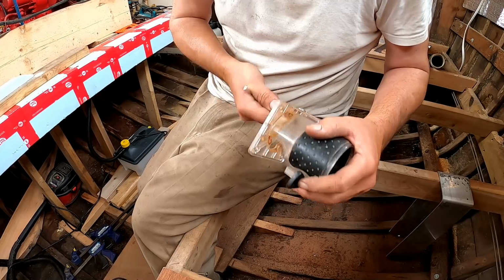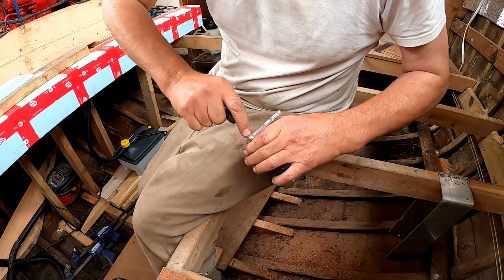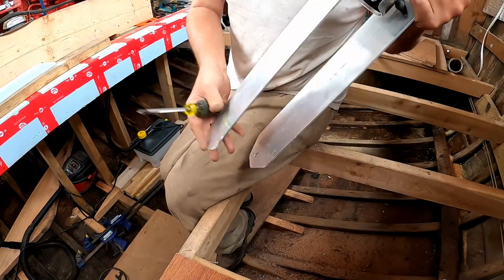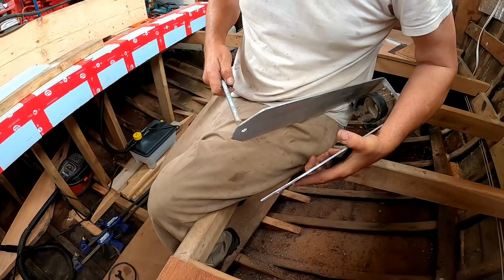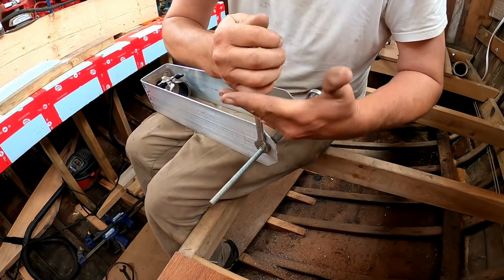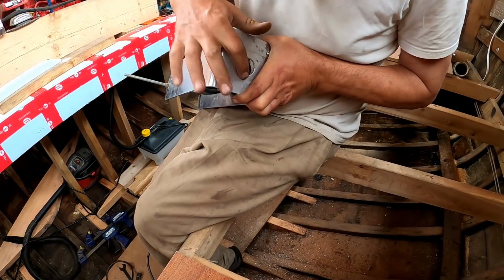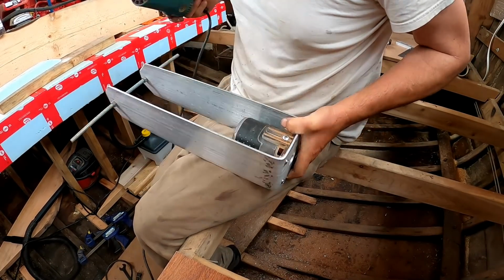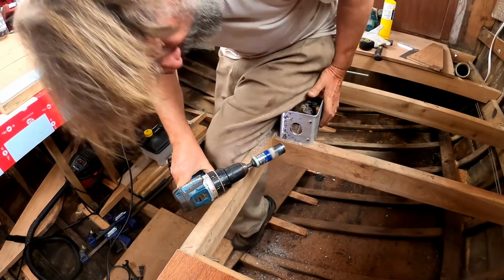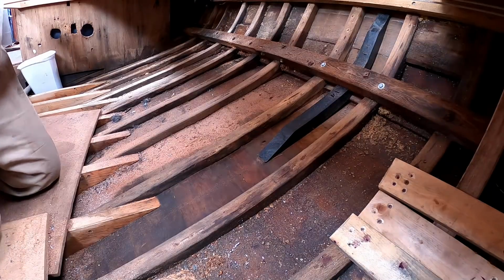Actually, to give this a little more stout, I'm tapping these holes out to 10-32 for some slightly stronger screws. Those tiny little 8-32 or whatever they were just a little small. Well, this isn't elegant, but it's going to work. Okay. It looks like something anyway. Eh? What? Who knew the hole wasn't centered on the base? Try that again. Nice. Okay, now setting it up.